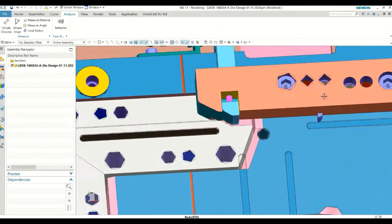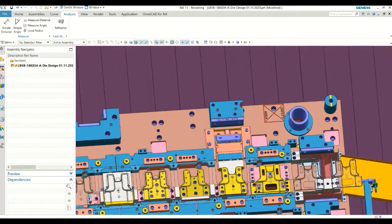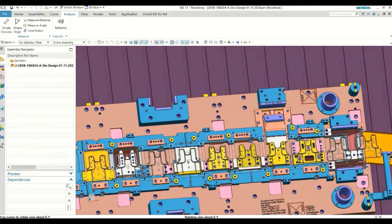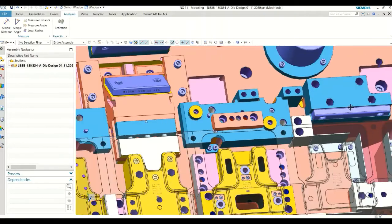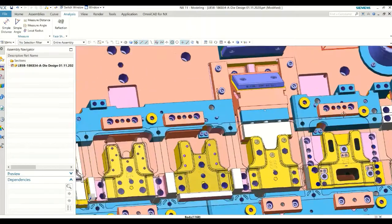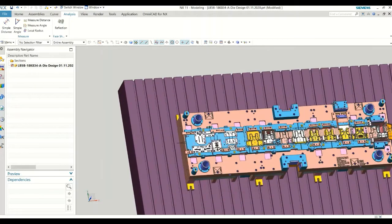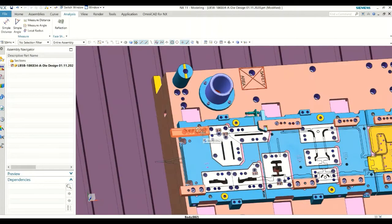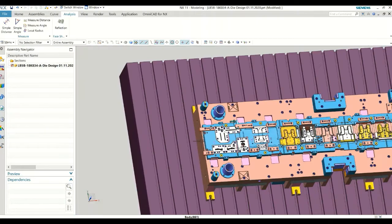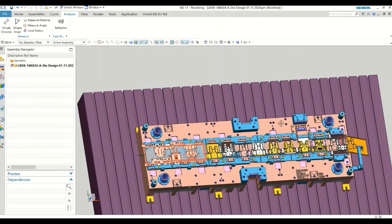This is my stock guide. This pin here at one end and another at the end of the die — we provide two pins throughout the length of the die, one here and one at the far end. You need to make the coil align to the die; it has to be in center with the press centerline. So when we fix this die on the press bolster, we manually match with this pin and that pin. If my coil is meeting this pin here and this pin here, it means it's straight.